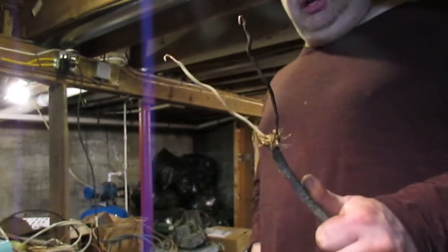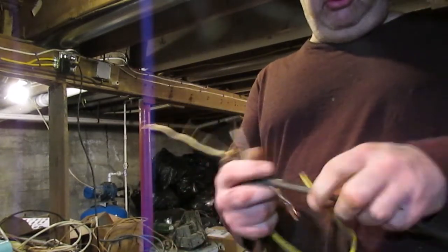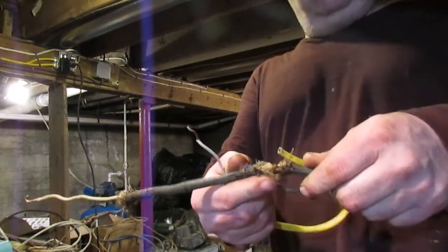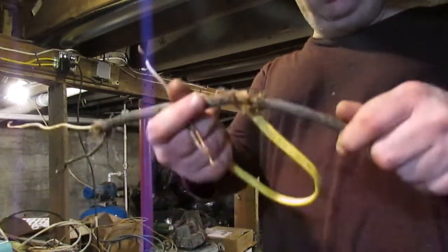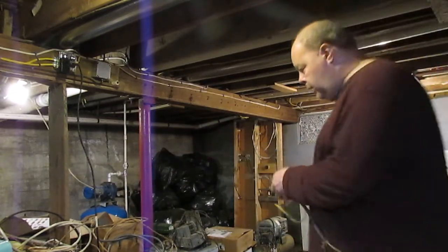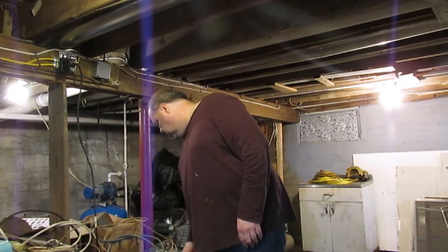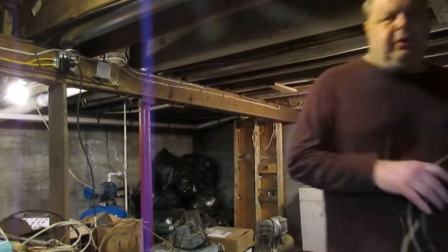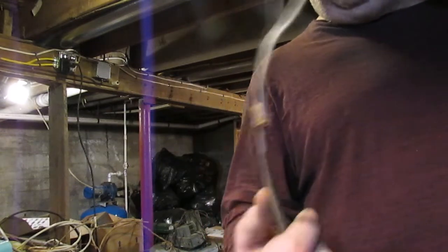So I think this stuff was probably excellent wire. It's just the jacket. If you mishandled this stuff, it would get all frayed. I think somebody got wound up in that one with a sawzall up in the wall when they were cutting out the outlet box, because it was like that when I took it out of there. They also made that stuff in 14-2. That's a piece of 14 gauge.